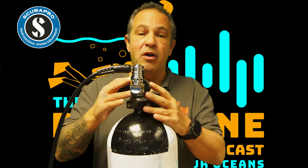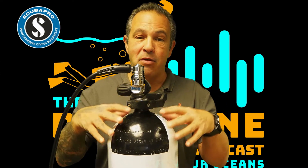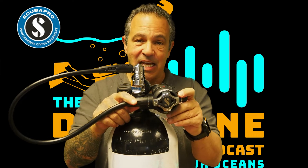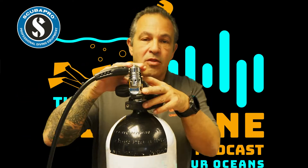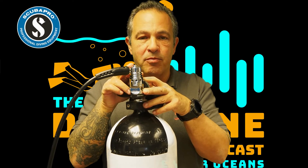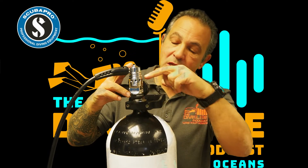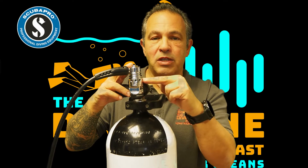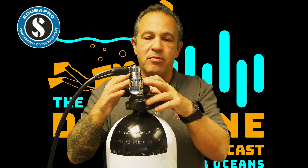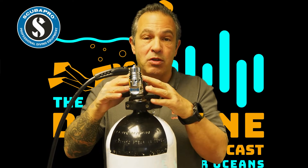A balanced piston is really the ultimate in first stage regulators — regardless of the depth you're at or the amount of air left in your cylinder, the intermediate pressure supplied to your second stage will always remain the same. The Mark 25 also has the EXTIS system, patented by Scuba Pro, which stands for Extended Thermal Insulating System. You can see the blue colour through the open ports — this thermally insulates the inner workings from the environment, meaning the Mark 25 Evo is equally at home in warm blue water or extreme cold conditions.